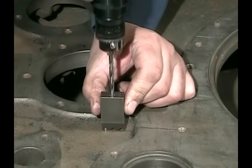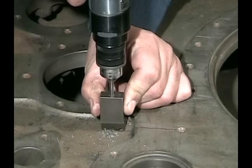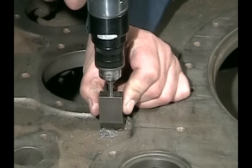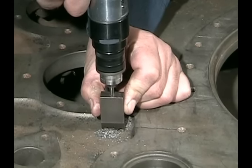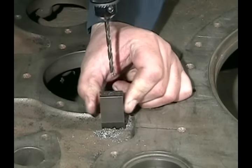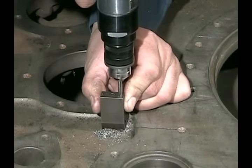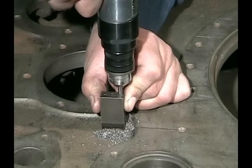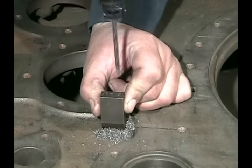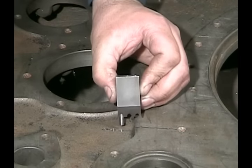This is the three-step method using the Elf 6500 spacing jig. The jig has one locating pin and two drill holes. You drill the first hole, then go to the second hole and drill it through the casting. We're going to continue this process by moving the spacing jig to the last hole drilled and continue drilling along the crack.